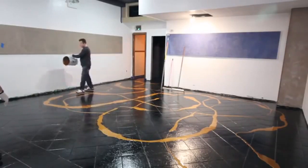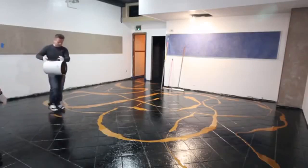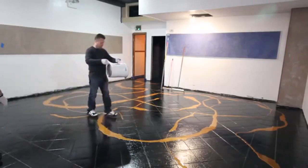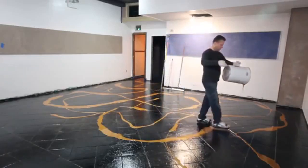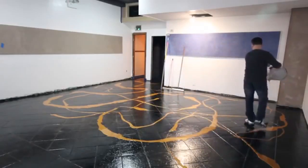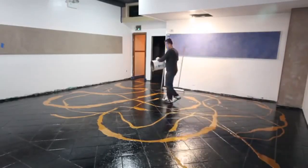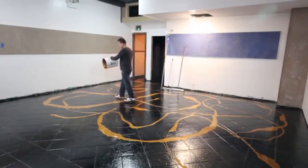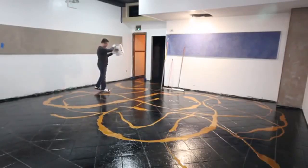But he's going to empty out this whole 3-gallon kit of orange gold epoxy onto the area here. And you can actually see up on the left-hand side there's a piece of blue painter's tape on the wall, and this allows the installers to know where each 360 square foot section of the floor is, so that they can concentrate on applying the material just in that area.